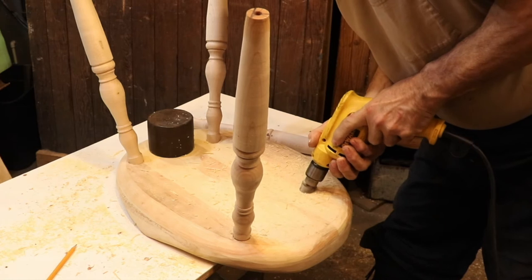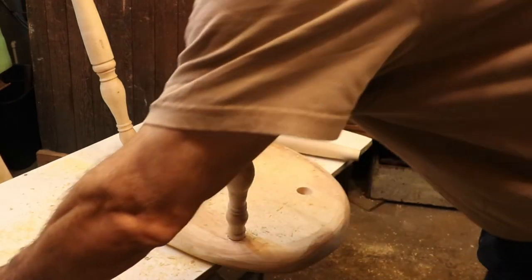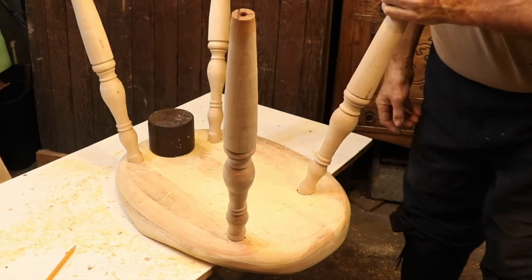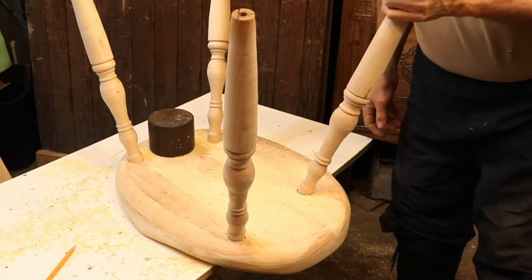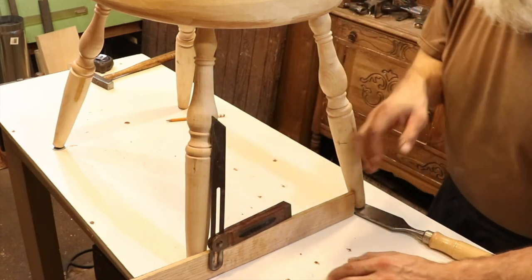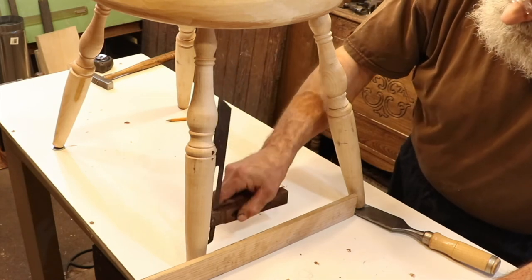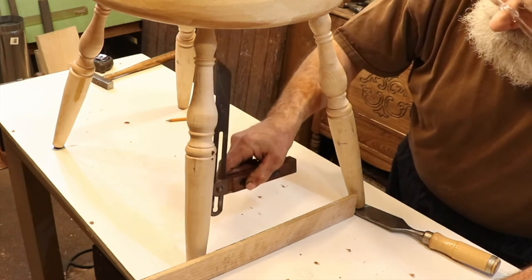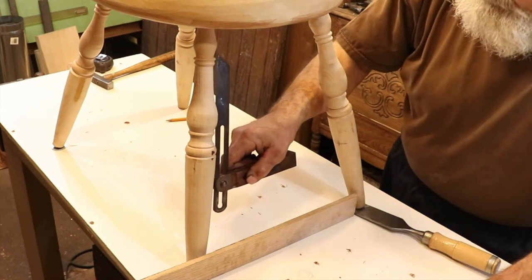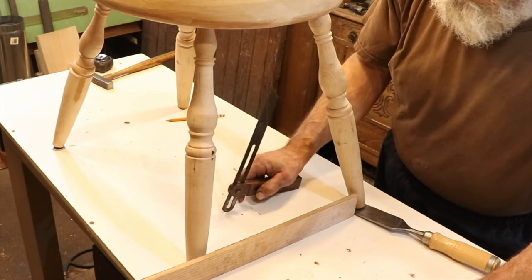The nice thing about these chairs is that there are so many angles and things going on — especially once you get the stretchers in — that it's really hard to tell what's lined up and what isn't, until you have it on a square surface where you can actually see how the legs aren't sitting in correct proportion with each other. So even though this is going to make the assembly of the chair a little more complicated, when it's all done you're really going to have to examine the chair closely to see that something's off — and regardless, I'm still going to wind up with a very sturdy chair that's very comfortable to sit in. I've corrected the angle as much as I can on that bad leg, but because I have the one leg out of position the left hand side of the chair is no longer a mirror image of the right hand side, so I have to go through a process of measuring each leg individually to get the angles I need to get the stretcher in the correct position.